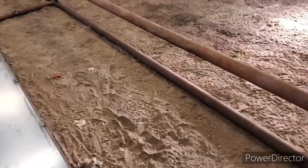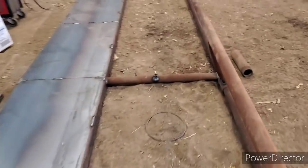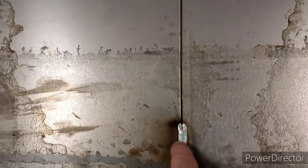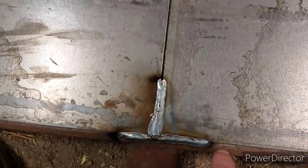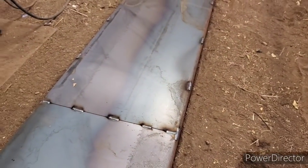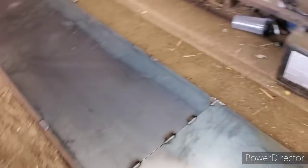I'll show you in the middle here — I gotta flip it up yet and weld up the back. See in the middle how I burn right through the tin? It shouldn't be hot anymore — burn right through the tin and then get onto the tubing underneath and that holds it nice and solid. Just little stitch welds and it don't warp on a guy.